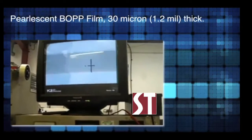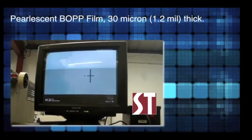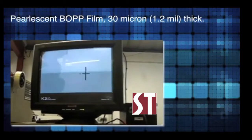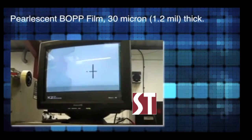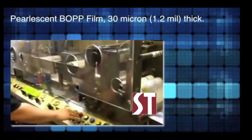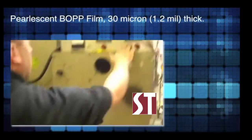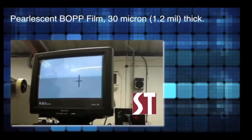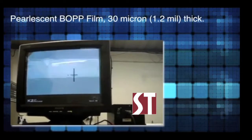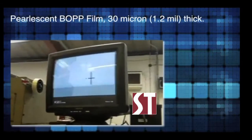He's just stopped and started the press and it didn't move. It's now back into register in 40 feet. Got to stop and start again. So Mark's now stopped the press and started it again. You can see the registration markers move a little bit on start-up. Now back in register, bang on 40 feet again.